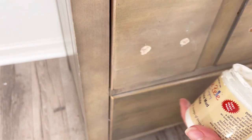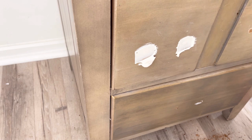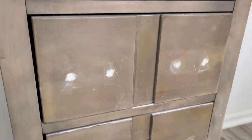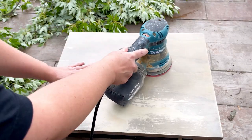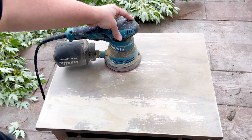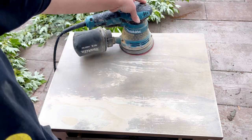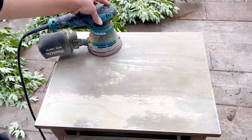Now I want to fill in the previous holes from my hardware, so I'm using Dixie Belle's Mud in white — you just spackle it on and wait for it to dry. Now I'm using a 220 grit to sand the surface. This isn't real wood and there's a little bit of chipping, so I just want to sand the surface nice and smooth. Then I take the sander and sand the fronts where I applied the Dixie Belle Mud, because I want that to be a nice flat surface.